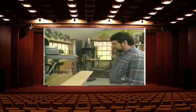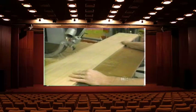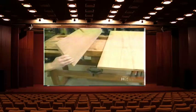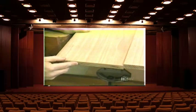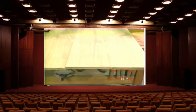To get started on today's project, I'm going to take this length of 1-by-10 oak and cut three pieces 46 inches long for the top, here at the radial arm saw. I'm going to flip this one over. When I line up the boards, I want to alternate the growth ring patterns. As you can see, on this board it's cupping up. On this one it's down, and on this one it's up. By alternating those growth rings, I'm less likely to get cupping over the entire width of the top.